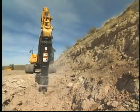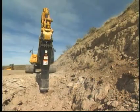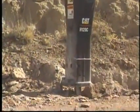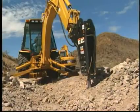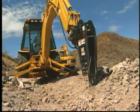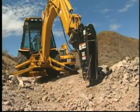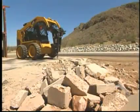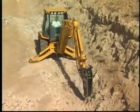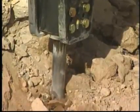Penetrative breaking, as the name indicates, is where penetration is required to fracture and help excavate the material. The material is often in its natural state in the ground and has not yet been excavated. The moil and chisel tools are used for penetrative applications such as trenching, benching, tunneling, and concrete. The moil tool is most universal and should be used in most general demolition applications involving penetrative breaking. The chisel tool can be used in benching and trenching applications, or where cutting or profiling an edge is necessary.